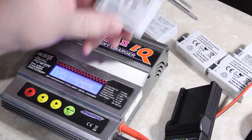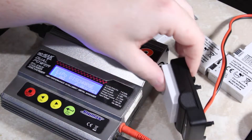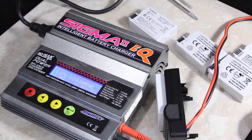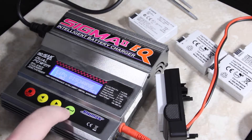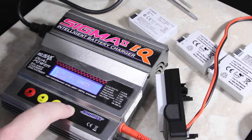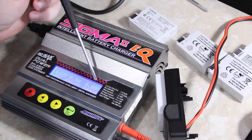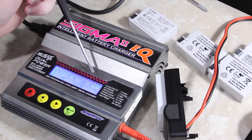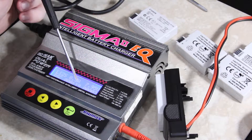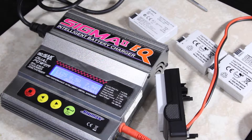Let's start with the cheapest batteries first — these no-name batteries. I'm going to set it to half an amp, because that will be a little more gentle and a good mix of video mode and photography mode. We want it to cut off at 6 volts. We can see here that it started out at around 8.2 to 8.3 volts, which would indicate a fully charged lithium battery, which is good. We're currently discharging at a rate of half an amp. The time elapsed is 18 seconds and the capacity drawn out of the battery is currently 3 milliamp hours. Let's see how far this will go.